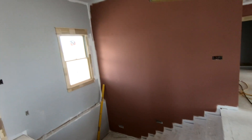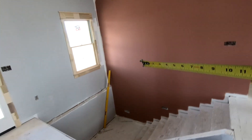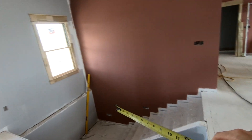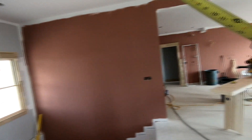It's never perfectly tight with this type of material, so by the time I get to the top it's going to grow higher, not shrink. So if I go exactly six and three-quarters times whatever even number, it'll still give me a little bit to scribe off the top.